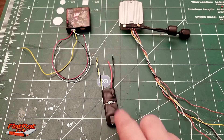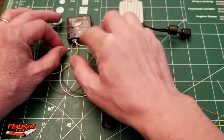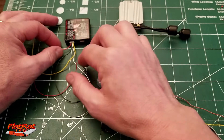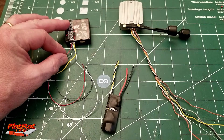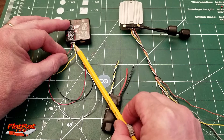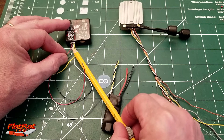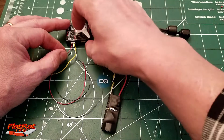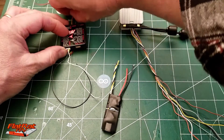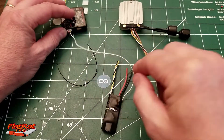Let's focus on the little units that you get from me. Looking at our vector — the mini vector right here — the outputs are going to be the same for the full-size vector or the micro vector, it doesn't matter. We've got the 5V out, ground, transmit, and receive. The only two we're going to be worried about are the ground and the transmit, which on this one are the black and the white wire. We're going to get the voltage and the receive out of the way, because we're going to be transmitting to our unit.